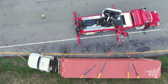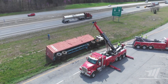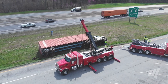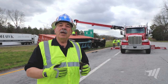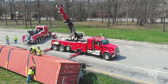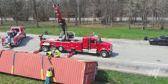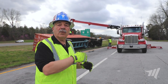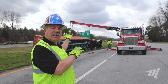We're stabilizing it and holding it while we're winching it out. We've actually turned the rotator around, and the reason is you want the boom to follow the load and follow it across the tailgate. We wouldn't want to do that across the front of the cab because we don't have the stability there. Not only that, if something breaks or comes loose, it's not going to slingshot into the cab of the truck. So we're rotating it with the outrigger legs all the way out — it's very stable across the rear, and we have the ability of neutralizing the force that wants to take it over.